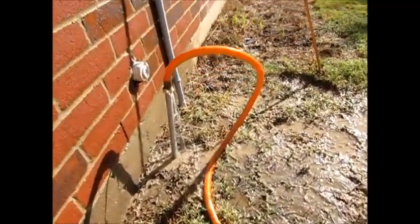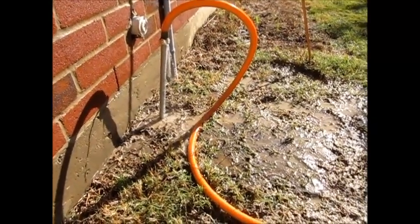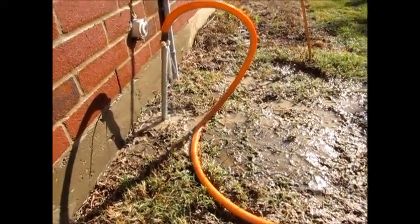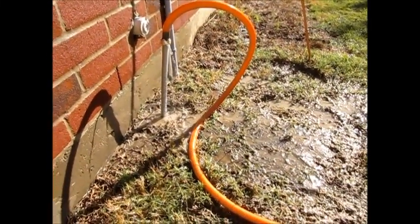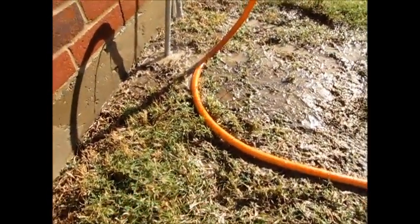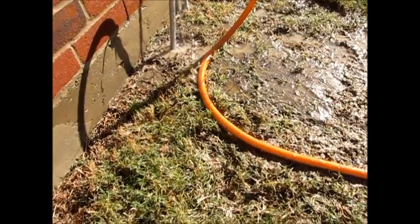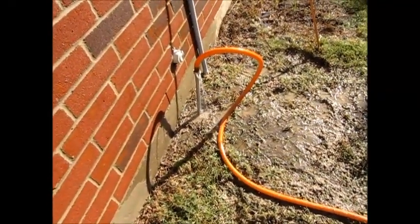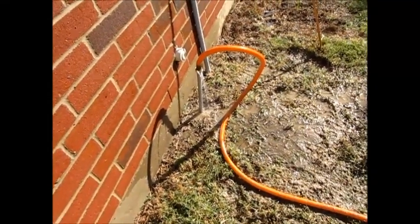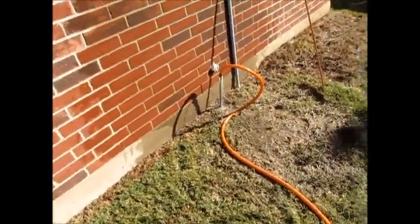When your conduit piece — if you've got a 10-foot piece like mine — is sticking out about a foot out of the ground, that's when you want to put your grounding rod in, because this rod is 8 feet. You're also going to want to put it down a little bit further than ground level so it doesn't get damaged. You've got to put the grounding rod in immediately after pulling this thing out, so have a mallet ready — it's going to go in there pretty easily, but you'll still need to pound it in a little bit.